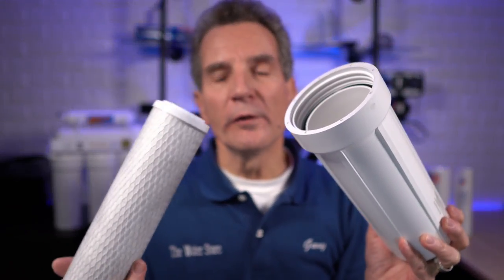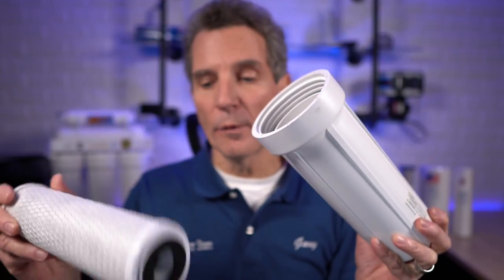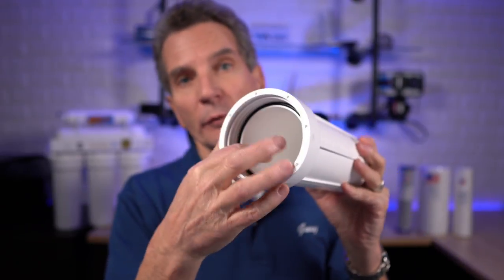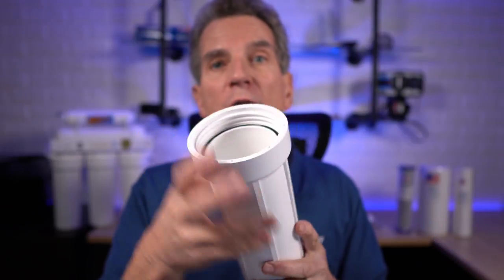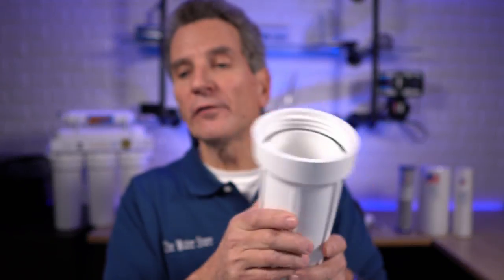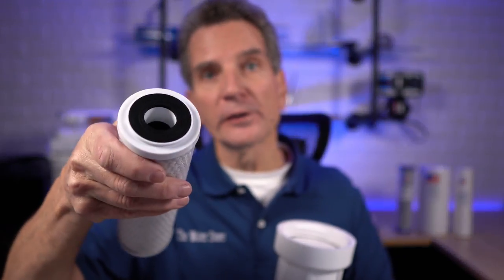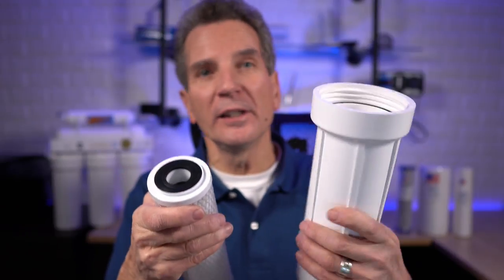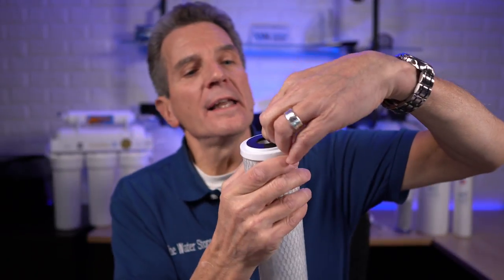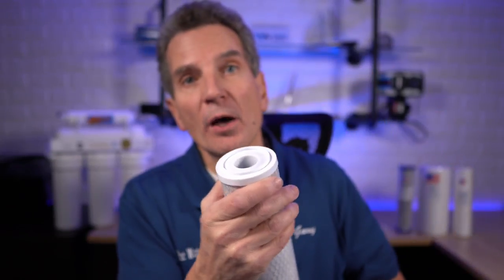Make sure there's an o-ring at the top of each filter housing. Remove that o-ring and wash out the housing using normal everyday dishwashing soap — do that for all three filter housings. When cleaning, look down inside to make sure the rubber gasket on the end of the filter didn't get left behind. I've seen that happen so many times — people keep tightening and it just keeps leaking because one of these little o-rings ended up stuck on the bottom of the housing, and they were trying to put the new filter on top of it and it just wasn't tightening.